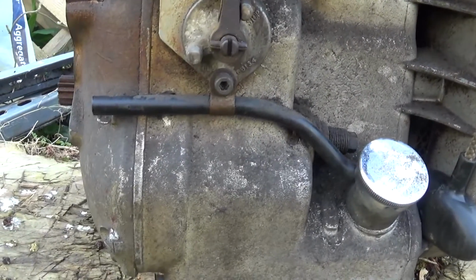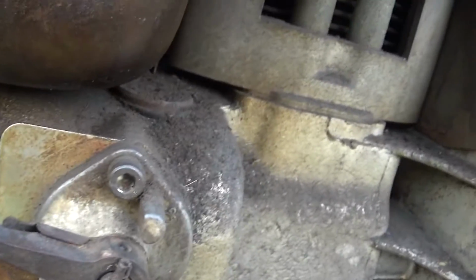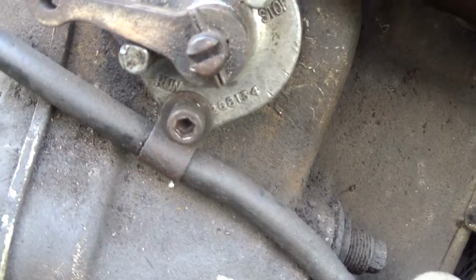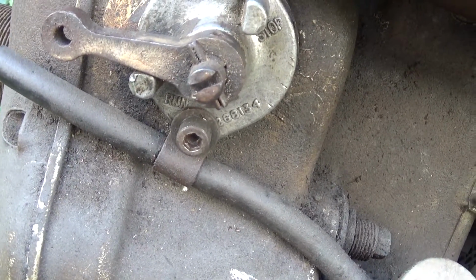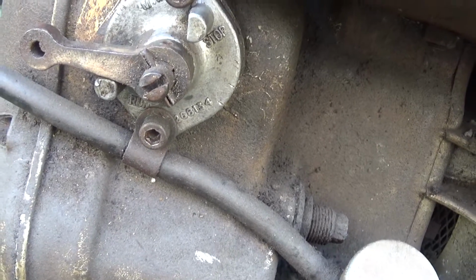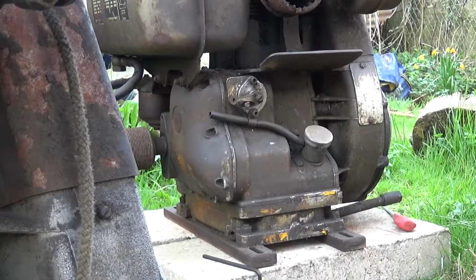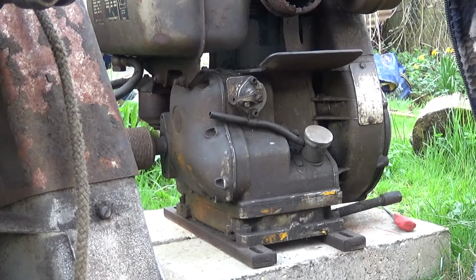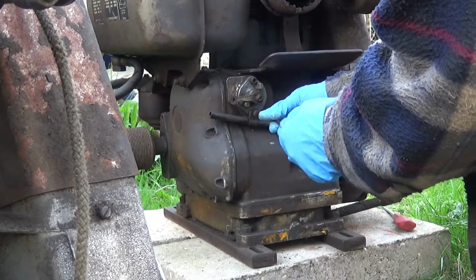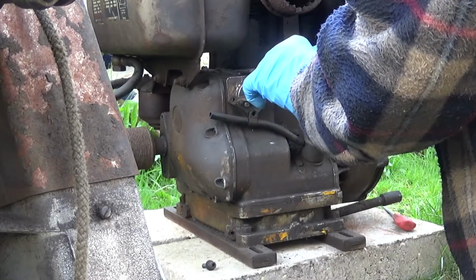One other quick thing of note is that those Allen socket heads look nice and not butchered at all. Whereas this socket head over here, I don't know if you can see there, but someone's clearly tried to jam the wrong size Allen hex driver in there. That is actually 3/16 and someone's tried to hammer in a 5mm. Fortunately I have the right size, so I can take that off and get on with it in a minute. Right, that's 3/16 in there, as I said, not 5mm. 4.5 might do it if it's not done up tightly, but I recommend using 3/16, which is the right fit.